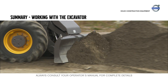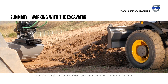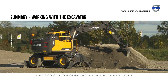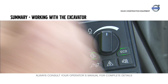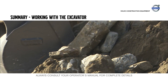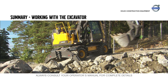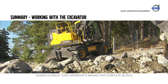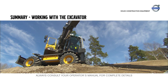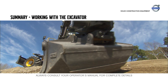Always prepare the ground and use the outriggers to achieve the highest performance. Flatten out the surface to achieve a flat working position. Always dig over the rear axle with the brake engaged. Control the engine RPM and the slew speed when digging on a slope. Handle the machine more carefully since the load can change the balance of the machine very fast, especially on a slope. Reduce the engine RPM when grading to achieve a higher degree of controllability with less power for higher productivity.